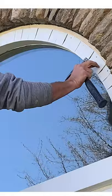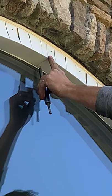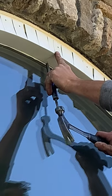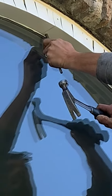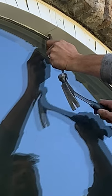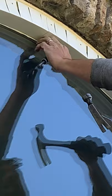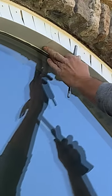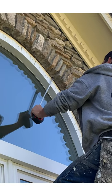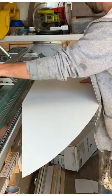It's the same thing — we just start feeling good about our spacing and our curvature and tack a lot of nails in it. Sometimes this is stubborn right here where those two meet and they don't quite want to line up, so I may tack a nail here. If it's a vinyl replacement window you're putting in, you don't have to do the driveway trick — you can just trace the round top before you install it. That makes it a lot faster too.